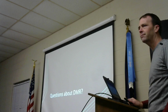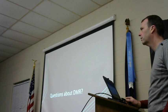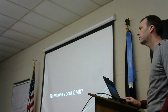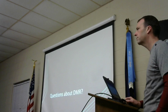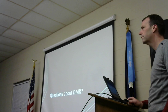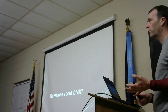Yeah. Is it a standard with Brandmeister? Because I know Chuck and Backyard Repeater Group are very adamant about having their talk group on time slot two. Would you consider basically your local repeater traffic would usually be on time slot one, and then if you are going to try to talk to someone, say across the United States, you want to use talk group two, or time slot two? Usually, whichever talk group you think is the most important or the busiest, you want to have by itself.